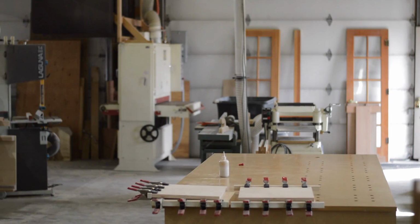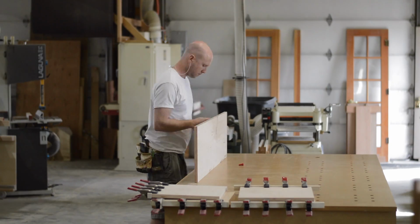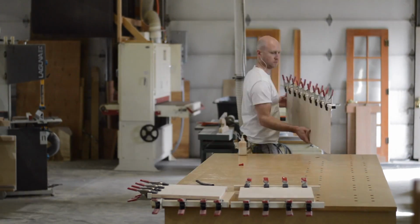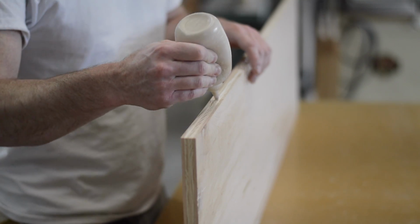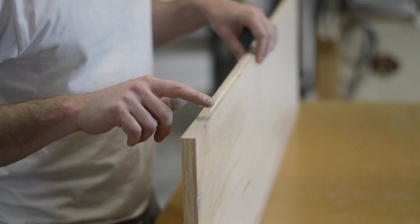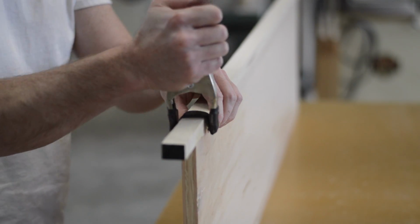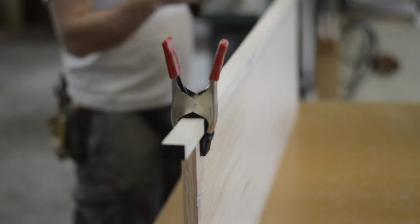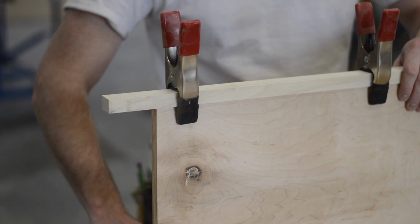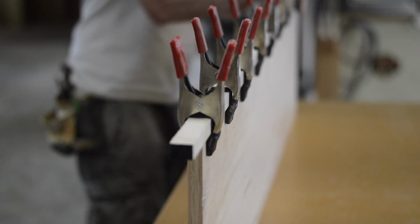So after breaking down a couple of sheets of plywood, it was time to apply some solid wood edge banding, which I do with Titebond 3 and some homemade spring clamps. And if you're interested in how I made these spring clamps, check out my channel and you'll find a video titled Built-in Cabinet, TV Console, and Floating Shelves. And I talk a little bit more about the process of making these. And I know that you can buy this type of clamp, but I felt like that was a little cost prohibitive. I ended up making 100 of these clamps for a little less than 150 bucks.